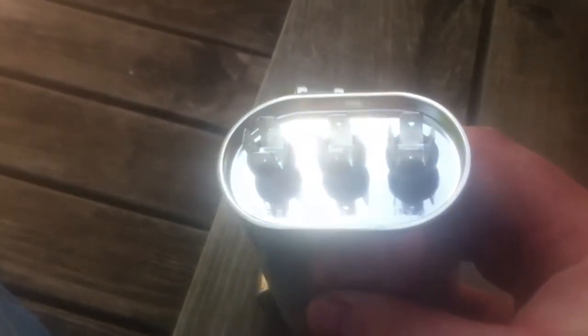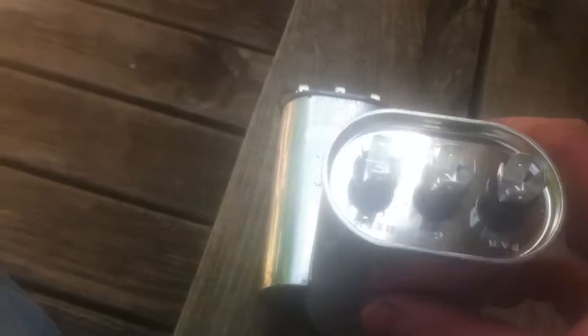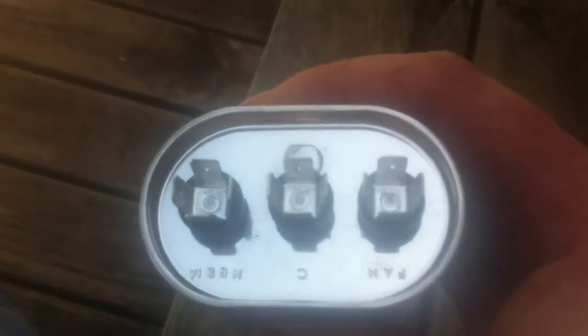This part I got at my local supply place for $17. You can open up the little access panel to your air conditioner — be sure and turn the power off to it first. You can take a look in there and just visually look at it to determine if that might be it. There's not a great way to test these unless you have a voltmeter that will test capacitance. Capacitance is usually rated in farads or microfarads. This 45-5 is a 45 microfarad and a 5 microfarad, and that's for running the fan, the compressor and so forth.